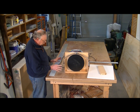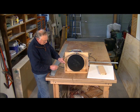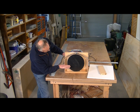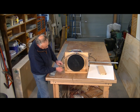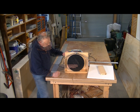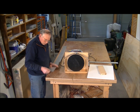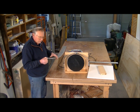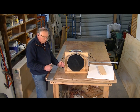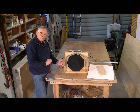What I've come up with, very simple, is a slotted hole in like a half-moon shape, with just a pivot point, and I'm going to mount it just below centre — about an inch below centre height I think. I've actually written a small program for the CNC machine, and I'm going to be making them out of this aluminium flat bar — it's one eighth by four inches. I'll be making four: one mounting bracket for each side, and then of course one mounting bracket that goes on the staging with the slot in it.